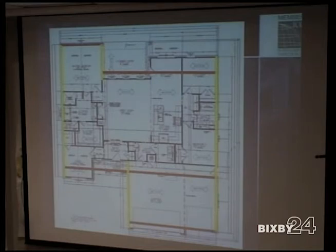But anyway, for this one here, I know that this brace wall line, by what I put into the calculations, needs 4.22 feet of bracing. So how the calculator works is you're going to put in your brace wall line spacing first, your eave to ridge height, your plate height, and what method you're using, whether you're using continuous sheath or chipboard method. And then it's going to ask a couple other questions in regards to what you put in for your method. You may not have to put anything else in. But then it comes back and tells you how much bracing is required. So I know that there's 4.22 feet of bracing needed on this wall line here.